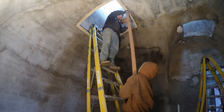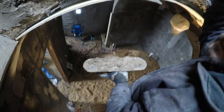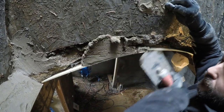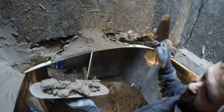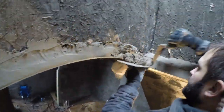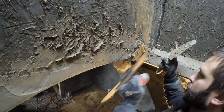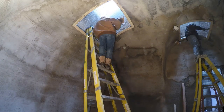I decided to add hard corners like the pros had done in our garage — basically thin strips of wood that give a sharp line and can be removed later. The shotcrete edges in this area were really rough, but I could fill them in nicely behind these wood strips and get nice sharp lines. In the end I think I just left them in place.